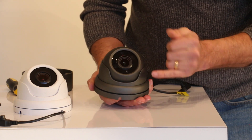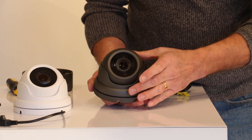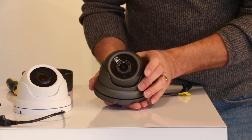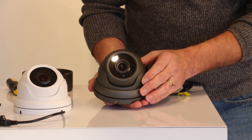Don't forget when you do mount the camera, you need to keep the light sensor or the small arrow at six o'clock on the camera face. That way your image is going to be the right way up. You also need to make sure that the side shield — the scallop — is aligned with the direction that the camera is pointing.